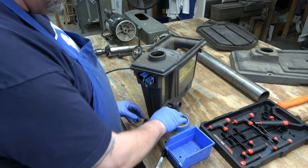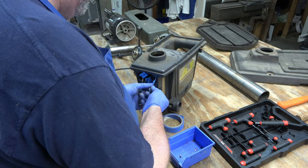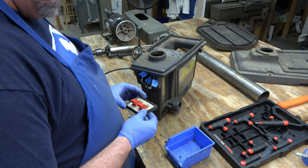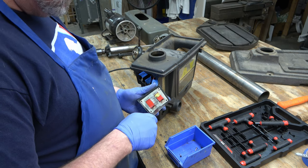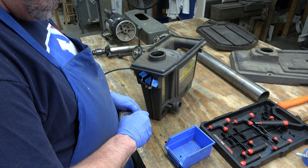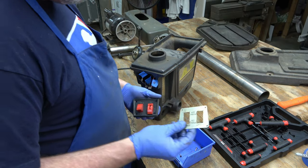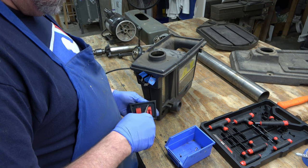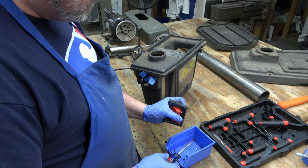And then we've got the plate off of there. Mark that last wire. Now we're going to disassemble this switch plate. The silver area on the front is a separate piece of aluminum, but to get it off you have to remove the lockout on that safety switch. And then there are two screws for each switch — one on top and one on bottom — that hold the switch in the plate. So we'll just undo those screws and the switch will come right out of there.